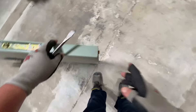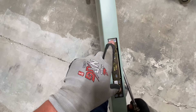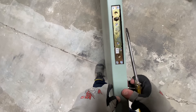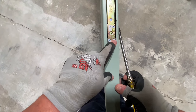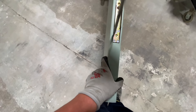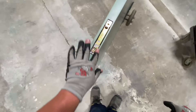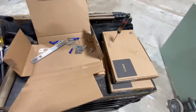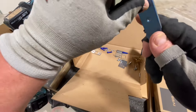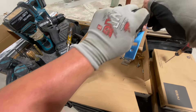Looking at the spacing, I've got about a quarter inch of that bolt sticking out on the bottom and I think that's what I want. Now I'm looking to fit that cover plate - I'm just trying to see if I have space for it. All your doors are going to be a little different; on this one the preps move around quite a bit. It's all going to be different depending on the specifications the doors are built to.